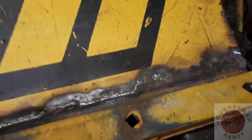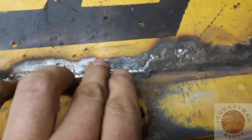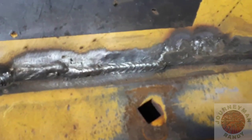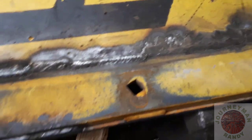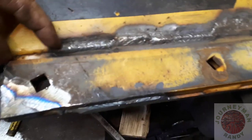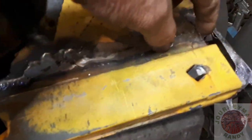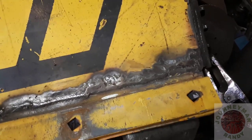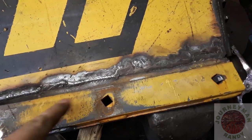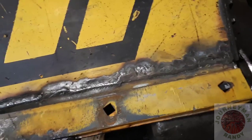So here's the front — it's about the straightest I can get it. Something behind here would not allow this to come down when I hammered on it, but that's the way it's gonna be. I just welded it solid. It originally just had a little inch and a half weld in the middle and one on each end, but it's welded solid right across now. Anything hitting the ground like that should be welded pretty solid. They should have added another inch, but it just adds cost and weight — they're trying to cut corners.